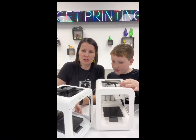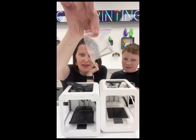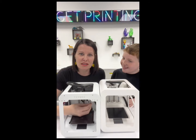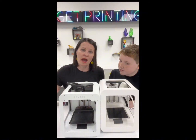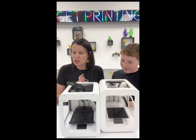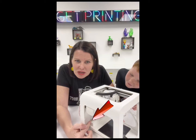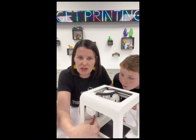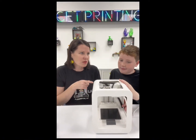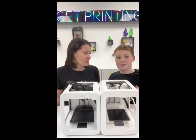Another feature I was really excited about: they say this has tool-less calibration. Alpha 1s all come with the dreaded baggie of Allen keys. I have to shove my big hand back there and use a tiny Allen key and a tiny screw to calibrate my printer bed up or down — and I usually say a lot of bad words during that. But right here on the Alpha 2 is a much larger screw that you can get your fingers on and turn to make it go up or down. Way better — and I lose that Allen key all the time.